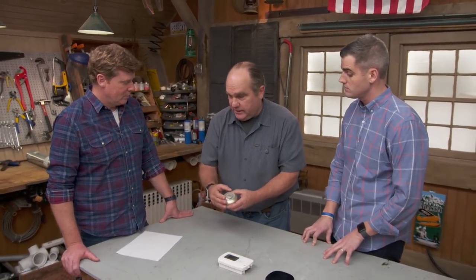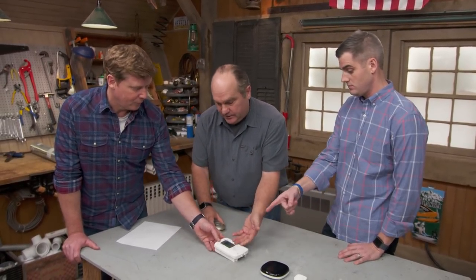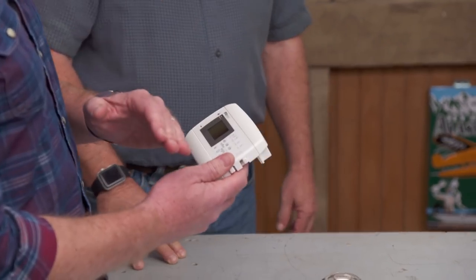So do I get away from all this complexity if I just get myself a smarter thermostat? Well, it'll help. Most people don't want to replace all their equipment, so they start with the thermostat. The thermostat has been a simple on/off device for many years — it says I'm cold, turn it on, and brings the furnace or boiler to full blast. Often that furnace has been oversized by the original installer, so it races. The idea was to do setback — reduce the temperature — so you do it manually or with a clock thermostat to go down when you leave, stay off during the day, and come back before dinner. But 50% of programmable thermostats that get onto the wall never get programmed.